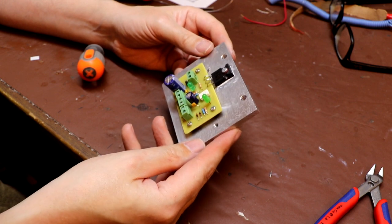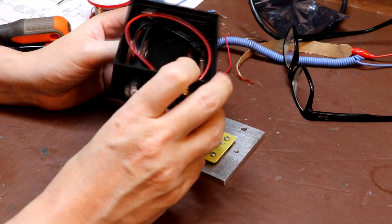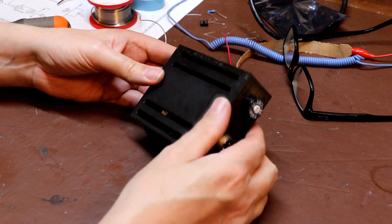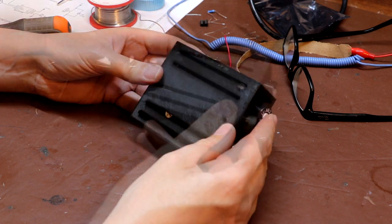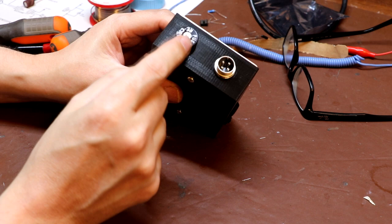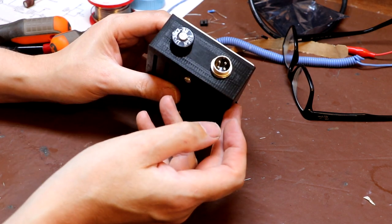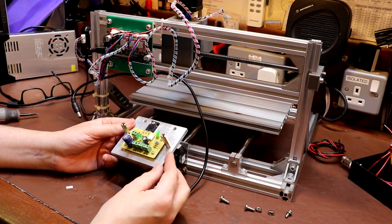Not exactly a bought one, but not too bad. The 3D-printed cover I printed — checking if it fits. Very close clearance over the capacitor — maybe one millimeter to spare — but it goes together. The thermal fuse currently fitted is a 3A type; I think I need a 5A or 7A rated one. I've got some higher-rated ones somewhere but that's a job for later.